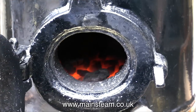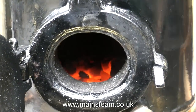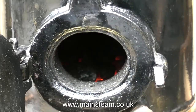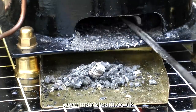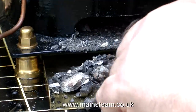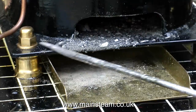Time now to check the fire — it's looking okay, but I think a bit of coal on would be a good idea, and I'll also rake the ashes out. You never want the ash pan to fill all the way up to the grate, because this will stop the air flow through the fire. I put this boiler plant together quite a while ago and I included a system for getting rid of the ash. Normally you would just pull the ash out onto the baseboard, but it's very messy. I've got this neat collector that allows me to dispose of the ash.